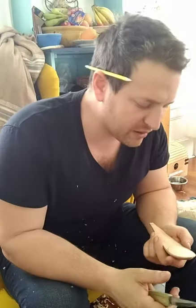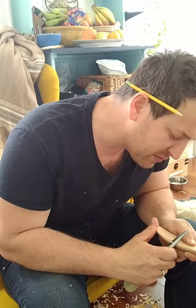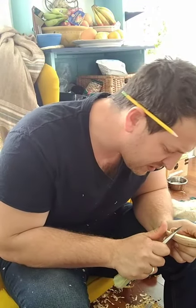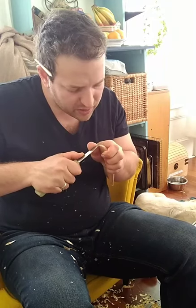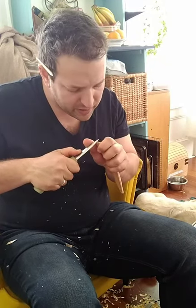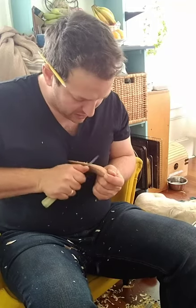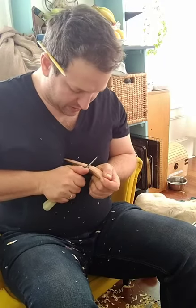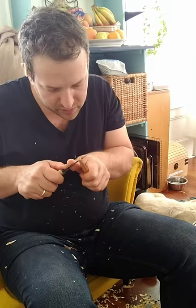Sean, the reason Sharpie first and pencil later. Well, Sharpie writes on wood that's pretty damp. So this cherry, even though it's been sitting around for a year, is still acting pretty fresh, particularly the sapwood. Depending on the type of wood, I actually prefer a Bic pen, but I don't have a Bic pen in my pocket right now. So this happened to be the green Sharpie that I had in my pocket. And pencil later is basically because I don't want something that's going to leave a mark that's going to potentially stain the wood once I've gotten down to those finished surfaces.